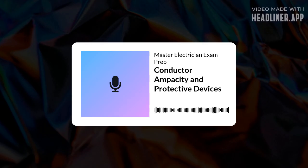What kind of trouble? Unbalanced current flow. For them to share the load equally, they must have the exact same length. Okay, same length. Same conductor material, all copper or all aluminum. Same material. Same size, like both 4/0 or whatever. Same size. Same insulation type. Same insulation. And this is key too, terminated in the exact same manner. Wow, okay. Everything has to match perfectly.